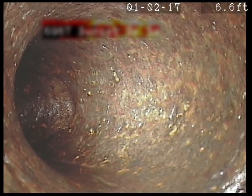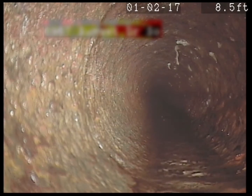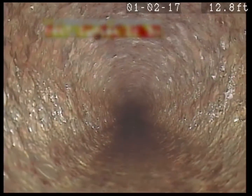All right, so here we are — it's got a combination turn to the left at six feet, and an inlet coming in from the right. Looks like it's small in diameter. Looks pretty wide open. That's good so far — yeah, it looks very good. My office is clear.